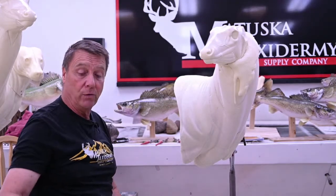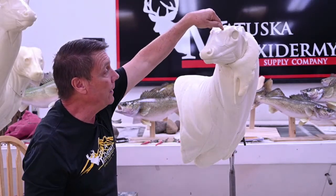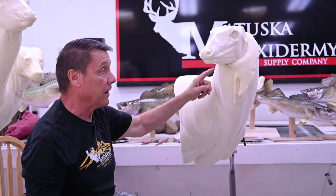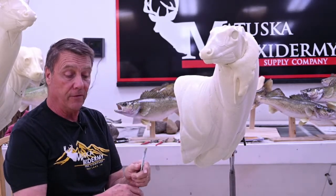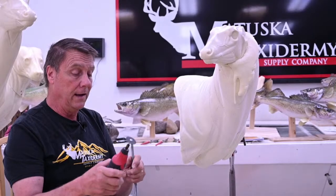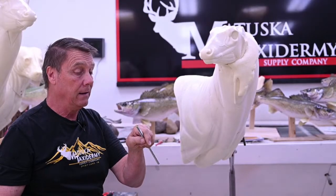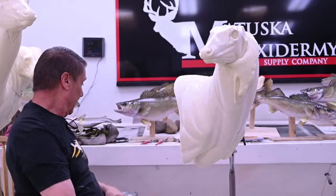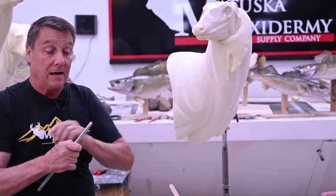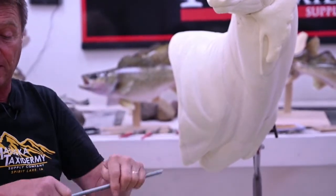One of our methods is we'll take a piece of ready rod, and I'm going to put that ready rod right through the forehead, and I'm going to angle it so that it can hopefully fall right down through most of our cuts. To put it in, the first thing I did was, with this nice little abrasive disc on the Dremel tool, I made a slot in the top that I can get a screwdriver bit in. And I sharpened the other end. I usually make a little pyramid tip on the tip.